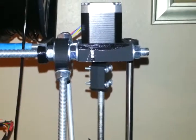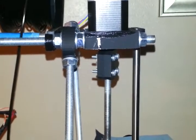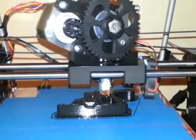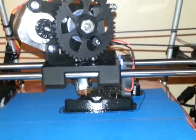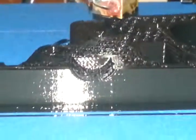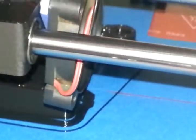So when it moves, you should hear it again in a moment — you'll see it happen. There we go, that was a move. There's another. It won't lift enough where you can actually see it lift — it's only three-tenths of a millimeter. It lifted the head up, moved it, and dropped it back down. And what that's going to do is keep down the stringies — little hairs of filament being stretched across openings. You can see that gap there is nice and clean. It lifted and moved across there, and you don't see any stringy, no hairs.